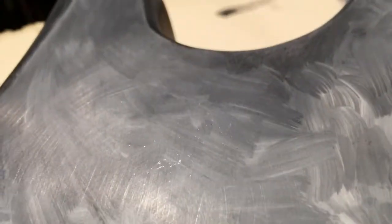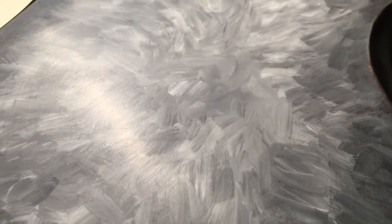All right, I had a couple trouble spots I had to go back and hit again with the 320 and 400. But here's an overview of how it looks right now. You can see a little bit of texture — I'm not going to worry about that because it's the back. You can see the swirl marks from the sandpaper, and you can also see how smooth it is. The brush stroke texture is gone. This is as good as it needs to be for the back. Right through here was the trouble spot. It's good enough for the back because it gets belt buckle abuse — this is a guitar for a bar, not a showpiece. You can beat this one up, take it home, and repaint it.